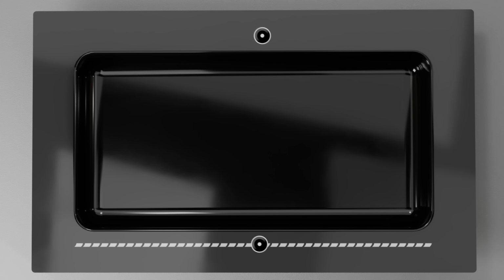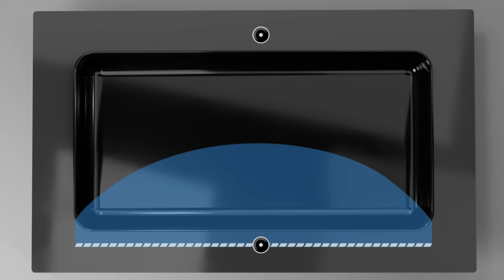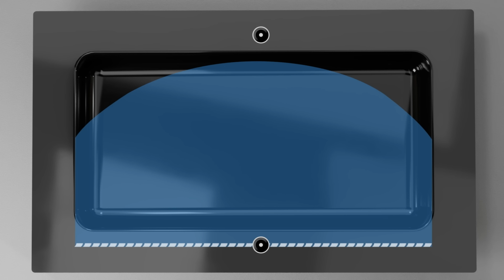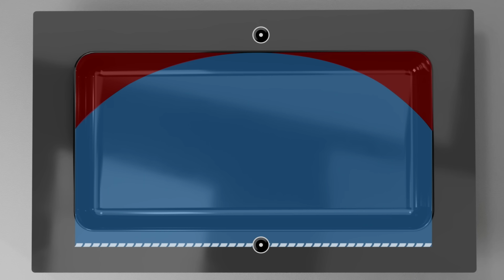This time we'll reduce the flow distance by infusing across the part instead of along it, meaning that we're within that 500 millimeter rule. So we release the resin and now it easily reaches the other side within the pot life of the resin. But now we do have another problem. Our resin has hit the vacuum connector before the whole panel is infused, meaning that we can't maintain proper vacuum to these areas. This one is an easy one to fix.